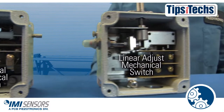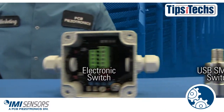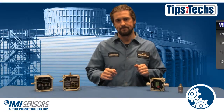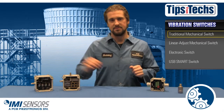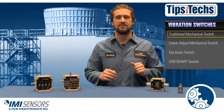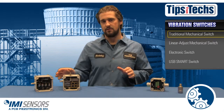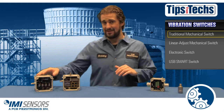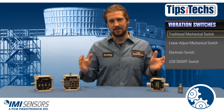Any vibration switch can play an important role in protecting your cooling towers, but which switch will work best for you? The basic form of vibration switch is a mechanical switch. A mechanical switch will trip an alarm or shut down your machinery when it experiences excessive vibration. They do have their faults though — it is difficult to accurately adjust these switches, and in the time of need they could fail you and you could have catastrophic failure.